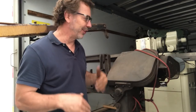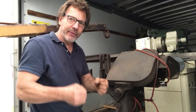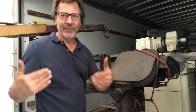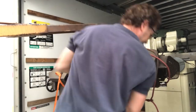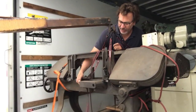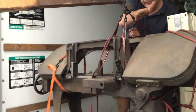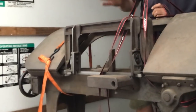The challenge to lifting any machinery is finding its balance point. We're going to try to lift in this area here. Be careful when the straps are pulling up — one of the challenges with something like this is it has a blade. If the blade touches one of the straps, it could cut it. Also, I've got this up against a point here, so if the whole load shifts the strap can slide. I try to put it against something that will actually stop that from happening.